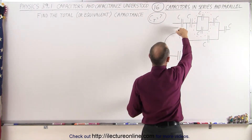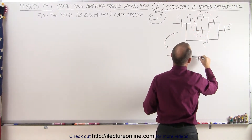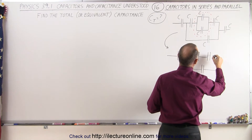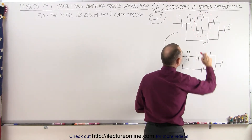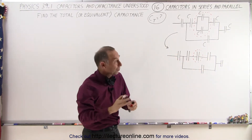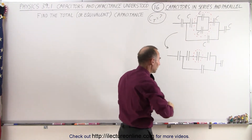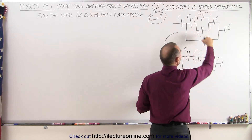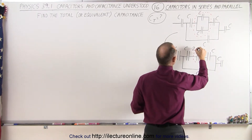So here we have the original capacitor over here, and these two in parallel will now be reduced to a single capacitor connected to that capacitor, and then here we have another branch. Sometimes it helps to draw little circles around what you're working on so you can see that everything else stays exactly the same except that one item that is changing. These are still capacitors equal to C, but these two, since they're in parallel — C1 plus C2 — become a 2C capacitor.